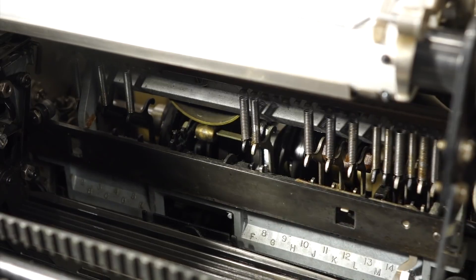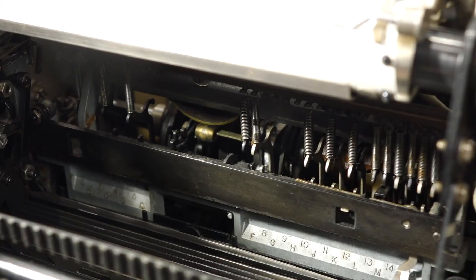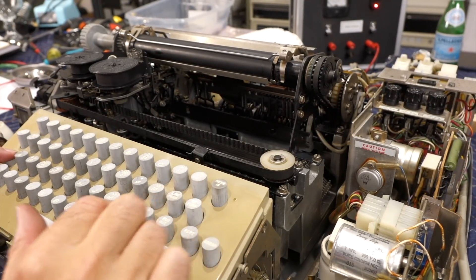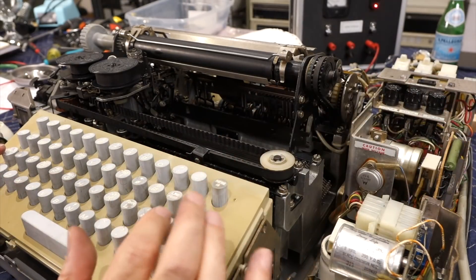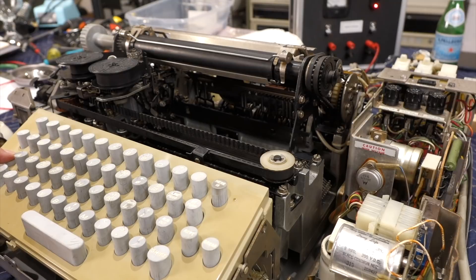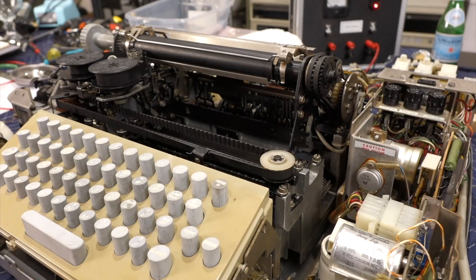For cinematic purposes, if I do Ctrl-L... it got shy of the camera, now it works! It works once! It was operator error. So when you do form feed, when the form is at the top of the form, it doesn't do anything. You first need to do a line feed and then do a form feed. So it's not a bug, it's a feature. Line feed, form feed — it was working all along.